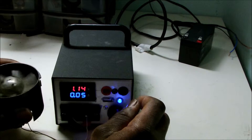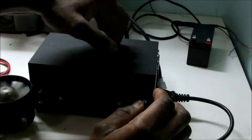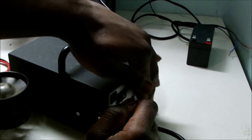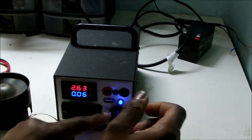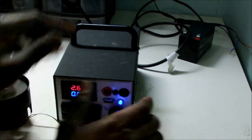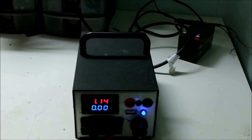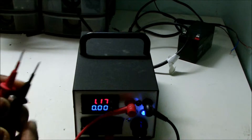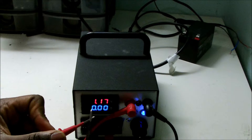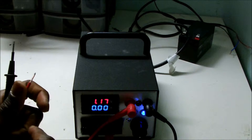Okay, we're at 26 — there's a dropout there because my heat sink is not big enough, so the LM317 is getting a little hot. But the fan is also working, so I'm okay with the result. I won't really be using that many volts anyway, so the range is fine. And I have a fixed 5-volt DC USB connector — there you go. Now I'm gonna go ahead and show you the continuity test. I can see the blue light — that means there's a connection, and no light means no connection.